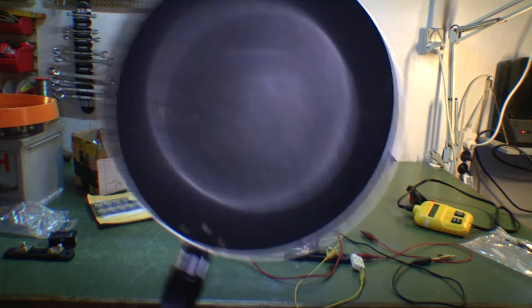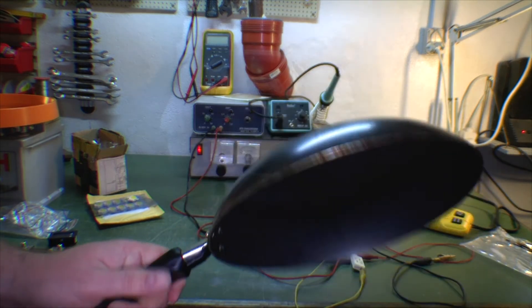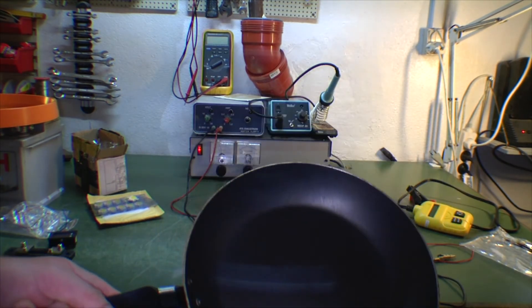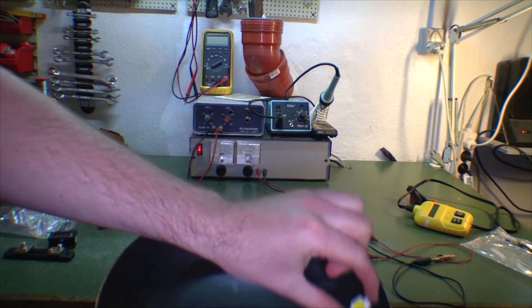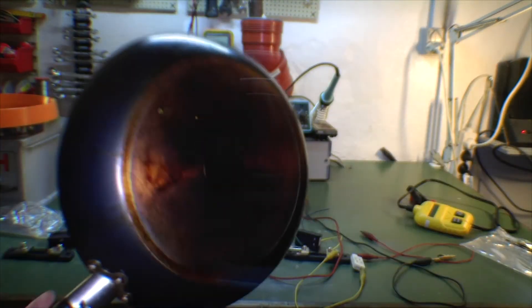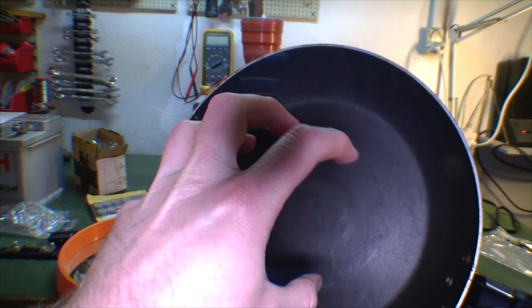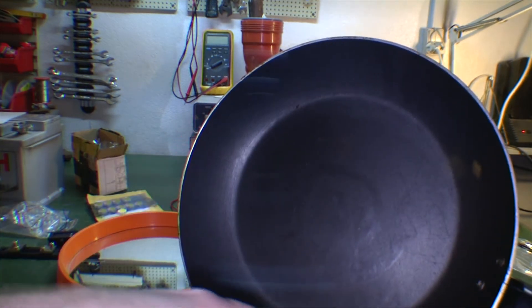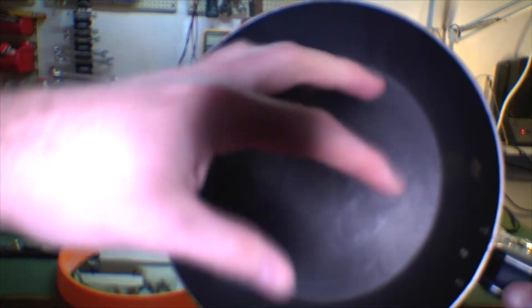I have a cooking pan here — it's made out of aluminum, and everybody knows that aluminum is a really good heat sink. I've seen someone else do this and I was gonna copy that — they mounted the light diodes in the pan, made a hole in the middle so it could go over the lens. I would make a hole in the middle, the lens sticks out here, and I would mount the light diodes around the pan flushing out in all directions, some straight forward too. This pan has a much larger diameter than the ring I'm using right now.